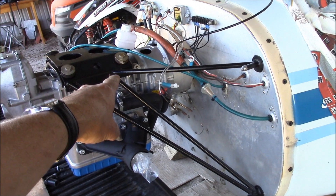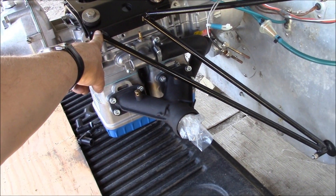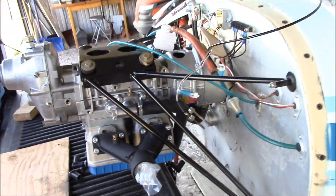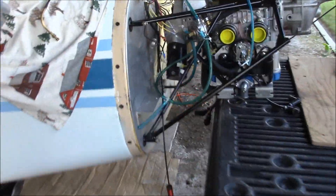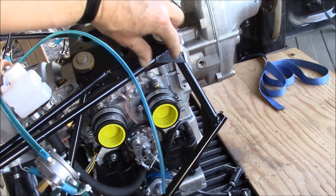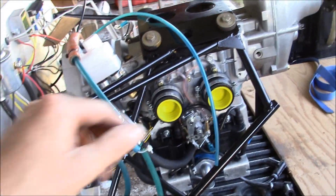So you can see this mount here - it's welded to the back of the engine plate, then you get another one that goes down in the V, where this third one comes up to the front. They're both welded on here, both sides were set up just like this, but that was for a 447 Bushmaster. They had a single carb, so that worked great, wasn't a problem.